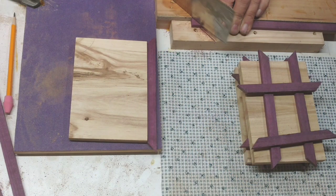A very common fix for a glue joint is sawdust and glue — use a little bit of Titebond or Titebond II, mix it with some of the native sawdust from your project, and you can fill some gaps. But what I have found is when the glue dries, it has a hint of color to it. So in some areas of your project, you're actually going to see some of that hue of the glue.